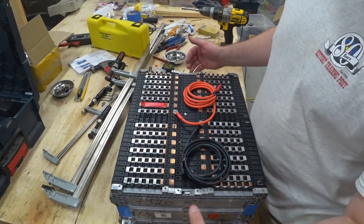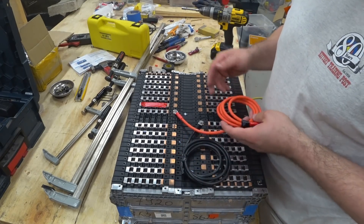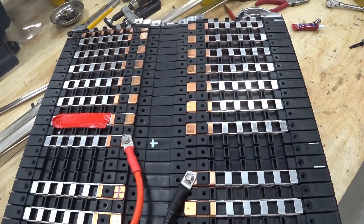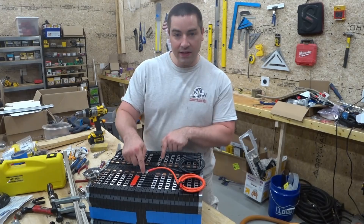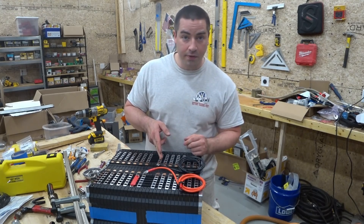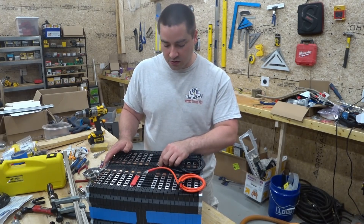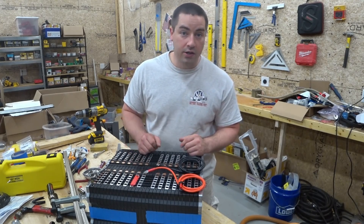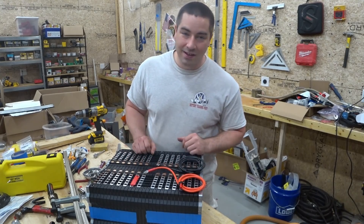This is the front of the battery where the circuit breakers are going to be going. That's why both of these are traveling off in the same direction instead of one going to the back. Now you can see the process I'll be using to attach these wires with ring terminals to the inside bus bars. All I have left to do now is re-spot weld the tab that I did break off, but that's identical to the last video that I put out. I think this is going to work really well — it's nice and secure, nice and strong. I did think about soldering these in place, but I thought this was going to wind up being a stronger connection in the end. With solder, if it was to get hot, I might wind up with a loose end in here, and I didn't want that.